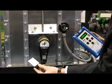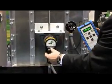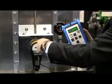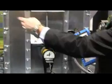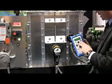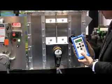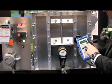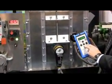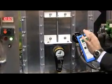By placing the Pulse Pilot between the M800 and the whirligig cover, the handheld system starts to detect the pulses. The shaft is running at approximately 100 RPM. We've got four targets, so we're getting 400 or so pulses per minute. We calibrate the unit by pressing calibrate — we're now telling this handheld unit that this is the normal running speed. We can verify a 10% underspeed is at 365 pulses per minute, and a 20% underspeed is at 324 pulses per minute.